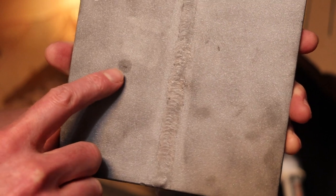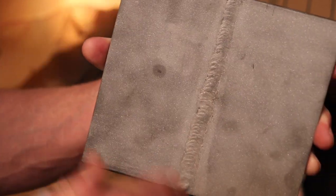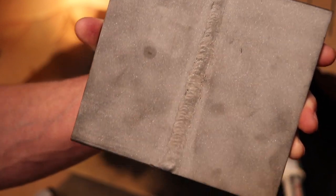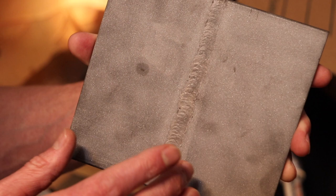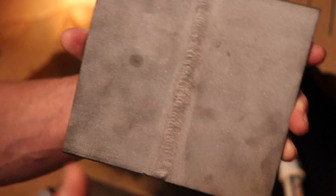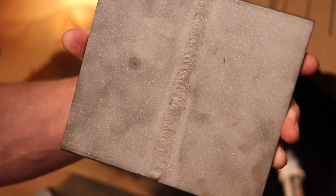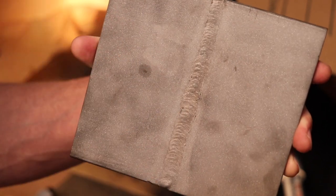This is a perfect example of what blasted metal looks like with oil. If you have an oil spot, it'll be dark, which means it needs to be degreased. If you coat it with an oil spot like this, you're going to have a fish eye where that oil spot is. I always degrease before I blast. If the metal has any built-up grease on it, I degrease it all before I sandblast. With a reclaimed sandblast system, if you blast with all that grease on it, it gets into all the blast media and you'll be blasting it continuously onto all your parts.